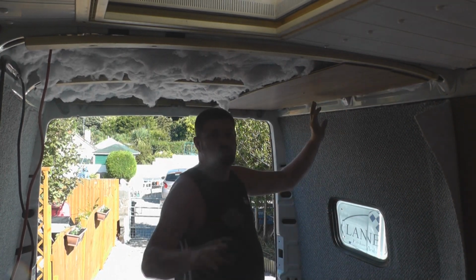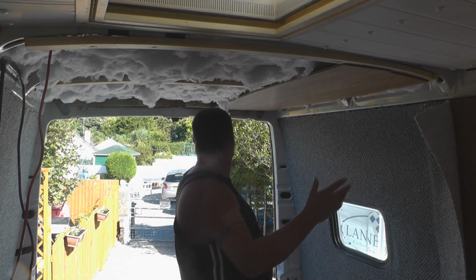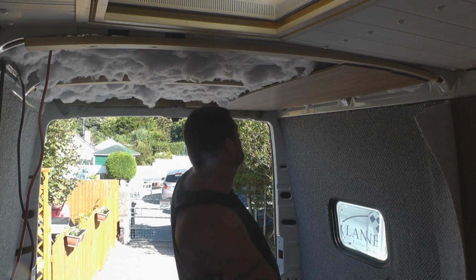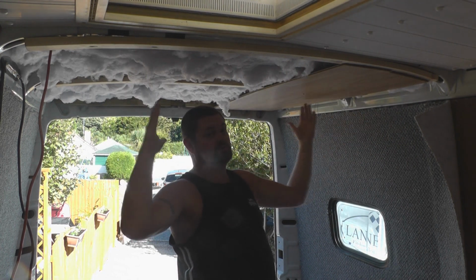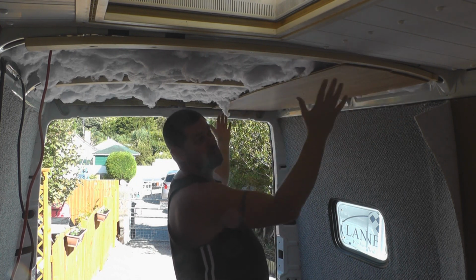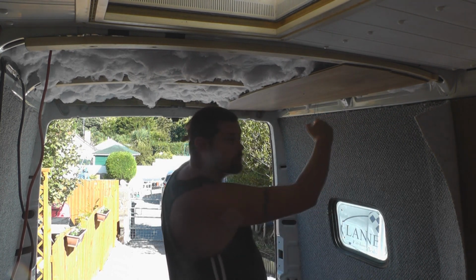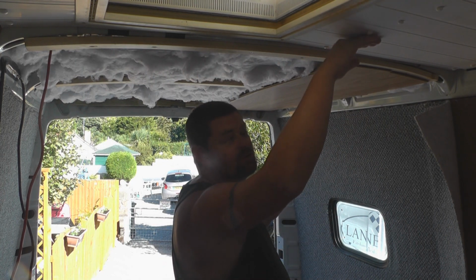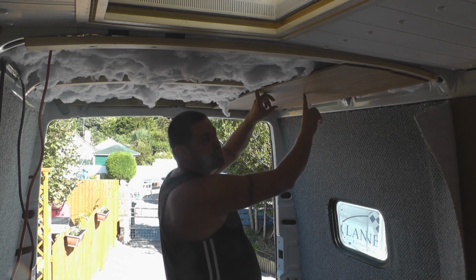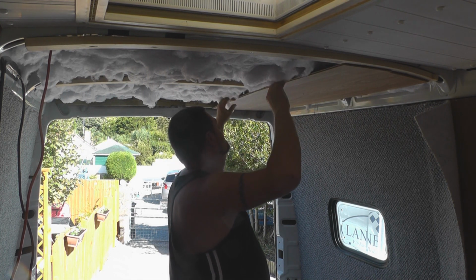Okay, put one board up, anchored it just in the centre, and then screwed some wood onto there. I had to screw 2 more battens onto it to bring it out a little bit more, because if I'd have gone this way along I'd have used more, which isn't a problem, but if going long ways I'm covering 2 parts of the roof almost perfectly, and it was too good an opportunity to miss. So I've gone that way across. Doesn't matter because it's a different ceiling there, so it doesn't look out of place. That screw there was like a pilot screw just to get this in line, how far I wanted it, and then the second one gone in.